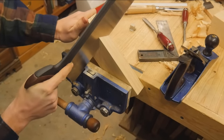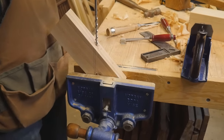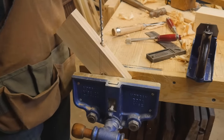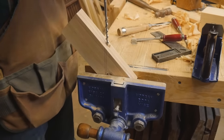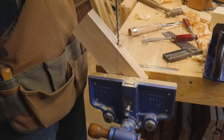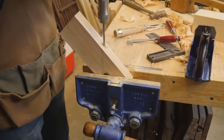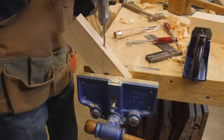Don't run the saw into the vise — this is a very, very tricky cut. This is the hole that the iron will fit through; the final width needs to be an inch and a half. I'm using a 3/8 bit to give me some space to chisel back to, just making sure that I stay away from the bed line.